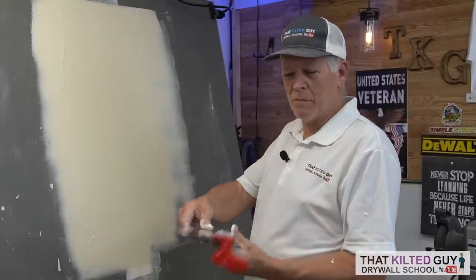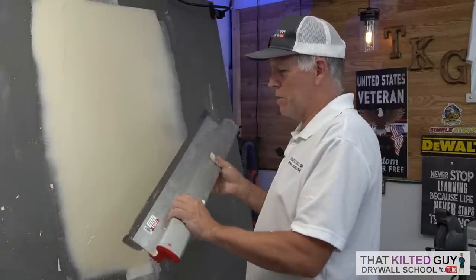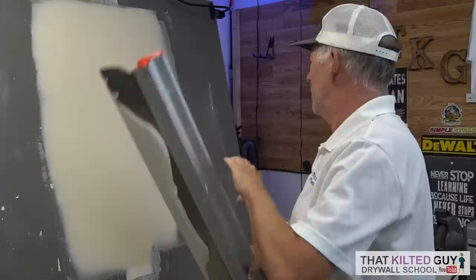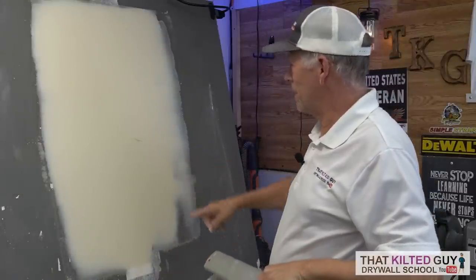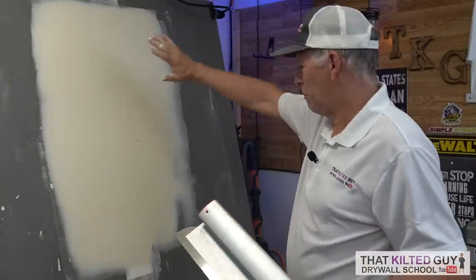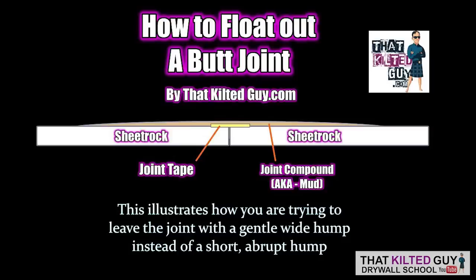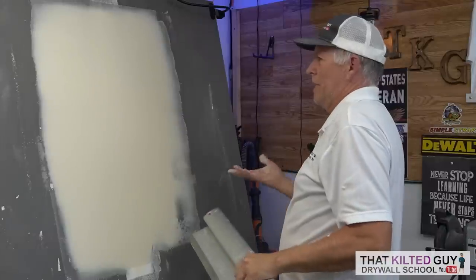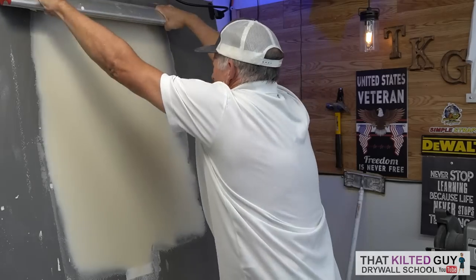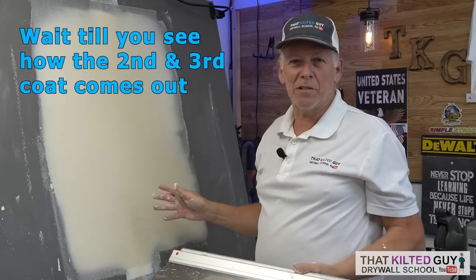These pro blades have a flexible blade with a rigid back, and that gives you some flexibility when doing stuff like this. Other than the fact that I hit it with my tool and left a little void right there, that looks a lot better. I want to pull as much mud off as I can to where I leave the joint tape just showing through with a slight radius. That looks great - no lap marks, a nice shape and a pretty good contour. We're going to let that dry.